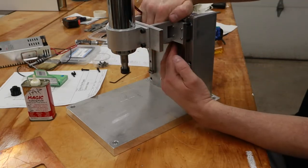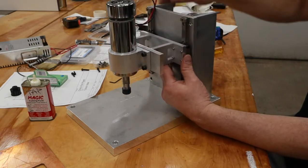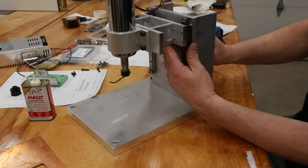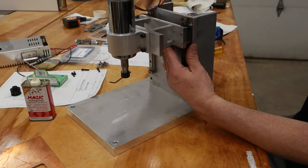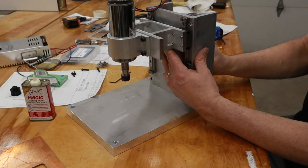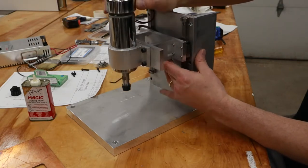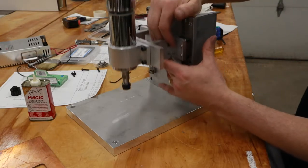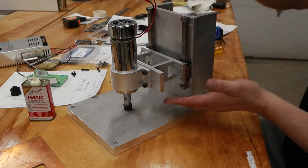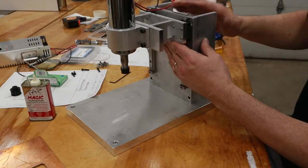So I could put a spring on there. I'm not a big fan of springs. I often find that they end up creating more problems than they solve over time. So pretty much my mind is set on having a counterbalance of some sort. That way I can very precisely control the counterweight for the counteraction of gravity working on this piece. With a counterweight, I can set that very, very precisely. And the advantage of that over a spring is that no matter where we are along the motion here, the reactionary force is exactly the same. Gravity doesn't change, but with a spring, the further you pull it apart, the greater the tension can increase. Of course, that depends on the type of spring and its overall length. So those will be the next things to figure out, and then we can move on.